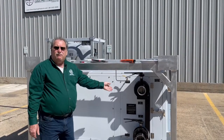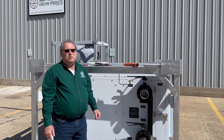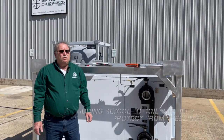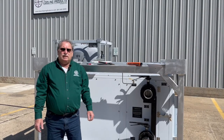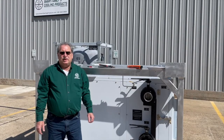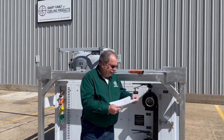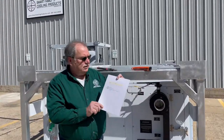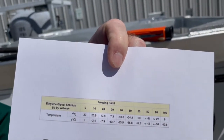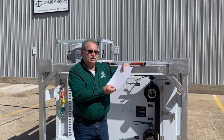The other thing you can do is fill it with a glycol solution — an antifreeze solution. You have to be careful because you need the right mixture. Depending on where you are in the country, it may take more or less glycol to achieve the right concentration for protection. You can find an ethylene glycol solution freeze point chart on the internet — it provides information based on percent concentration and the temperature you're trying to achieve.